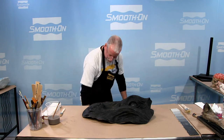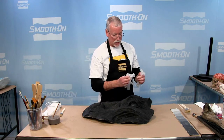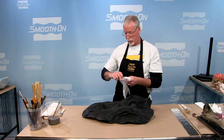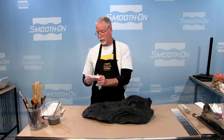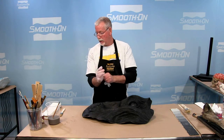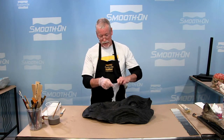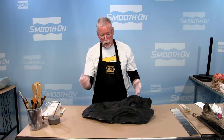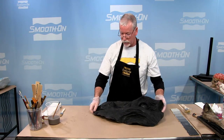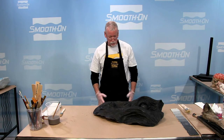a dry brush technique. So dry brush, when you're painting, you just can't have too much paint on that brush. So the idea here is not to get it in all the grooves. So what I typically do, get that paint on my brush, and then I use like a paper towel or a table, you know, piece of paper, and I go across that and take some of that paint off, because I don't want too much. It would get in all those grooves.